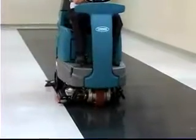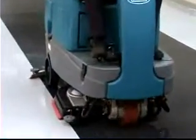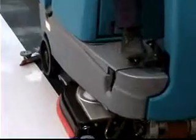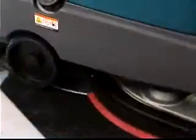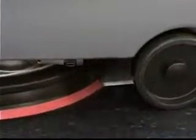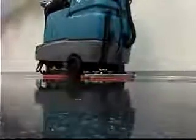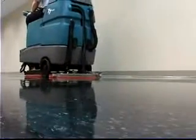Unlike conventional scrubbing, the optional FAST, or foam scrubbing technology system, operates by injecting the FAST-PAK concentrate agent into the dispensing system, along with a small amount of water and air. This mixture creates a large volume of expanded wet foam. The expanded foam mixture is then dispersed onto the floor where the foam and brushes emulsify the grime.